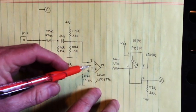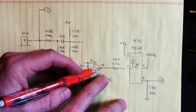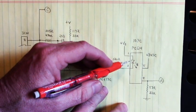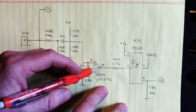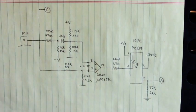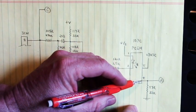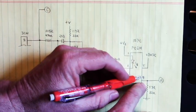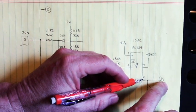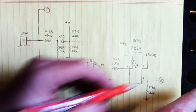Here is a voltage comparator that, when this output on pin 14 of the comparator is low, it turns on the LED inside that optocoupler and drives into the phototransistor, turning that phototransistor on. That puts 8 volts through the collector-emitter to this point right here, and this goes to a hybrid module.